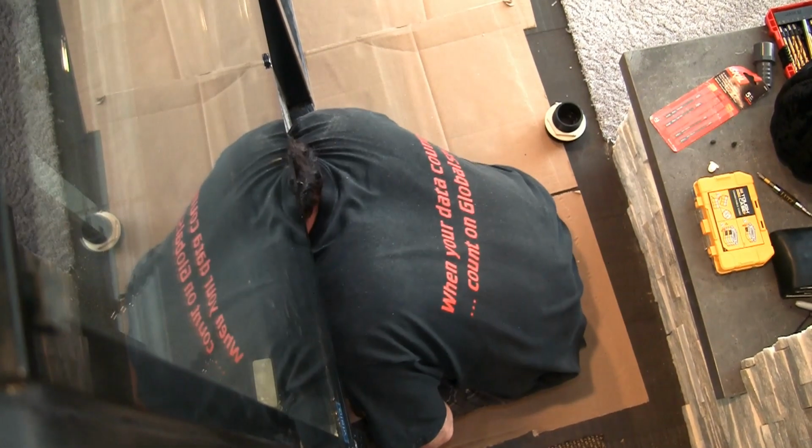So it's funny how things kind of turn out and then begin to snowball. Scott discovered way down at the bottom what is most likely just a drizzle of silicone. But the question is, is there a crack in the glass? So to determine that, the only way is to remove the bulkhead and kind of get our finger in there and see if we can rub away the silicone. I've stuck my finger down there and I think I've already rubbed it away, but as I mentioned, snowball. So now all of a sudden the nut on the back side of the bulkhead doesn't want to come off, and he's having to pound it with a hammer to get it to unthread, and that should just fly right off. So why is the nut being so difficult to come off? So obviously there's some cross threading or something going on down there. So that's where he's dealing with it right now.